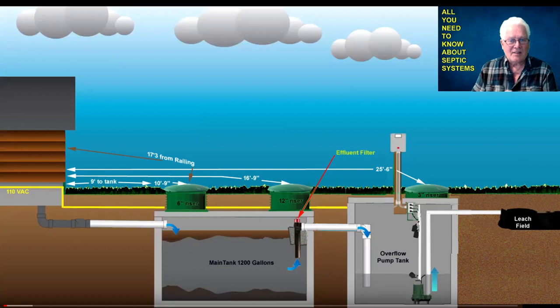From the pump chamber is another outlet, and I'll show you how to fix that so you don't have to keep cutting the pipe if you want to add an alarm or a float. You want to put a union in — I'll show you that too. That effluent now goes out to what's called the leaching field. Stay tuned — let me go right to my problem when my septic tank overflowed into my front yard. Stinky, stinky, stinky.